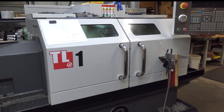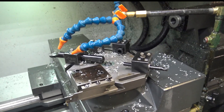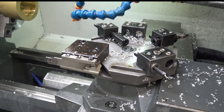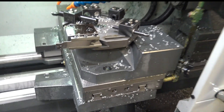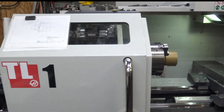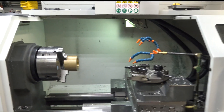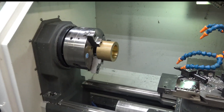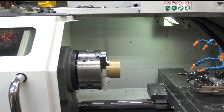This is our newest CNC. This is another Haas lathe. It's got a 10-inch chuck. It's got a horizontal turret — kind of weird. I didn't even know it existed until Haas pointed it out in the catalog. So this is a horizontal turret and it uses these tools. It's not the best turret design, but we're happy to have another lathe turret, so we're not complaining. It's a Haas TL1. It's got 12 horsepower and a 10-inch chuck. I think it's got like a 20-inch swing or something — not that we actually swing that big. We kind of max out like 14 inches. We could swing bigger parts if we put custom jaws on it.